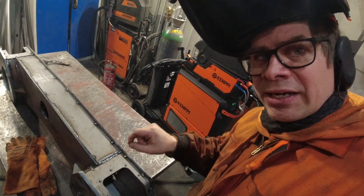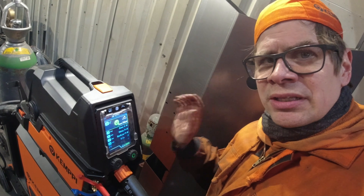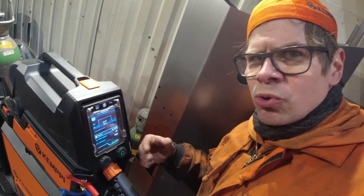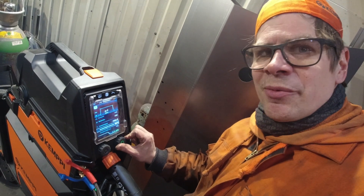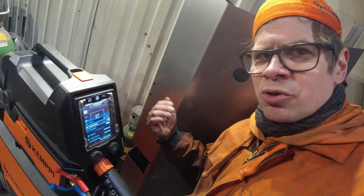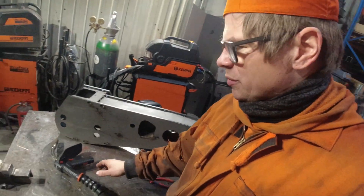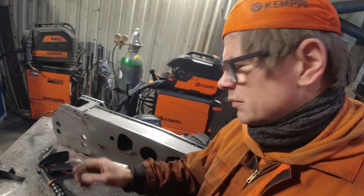Next time I will again take pulse and continue welding. But first, a short introduction to the user interface. The key thing here is the different memory channels. For example, I have channel number one where I set up different welding parameters — pulse and different settings like how much is the feed. There's a huge amount of different settings you can have. For steel I don't need all of those, but if I were welding aluminum or something more unusual, I would use them. When I have the channels set up and I'm actually welding, I don't have to walk over to the screen. I can have special programs saved and when I'm in that situation, I just switch from here and it will do different things.